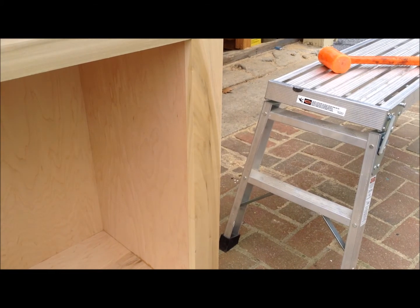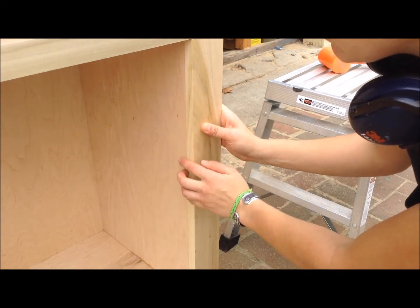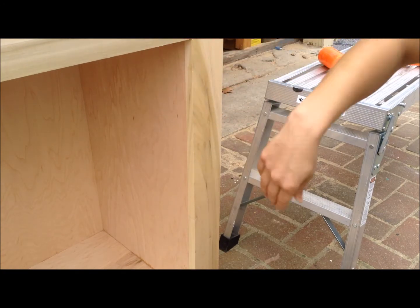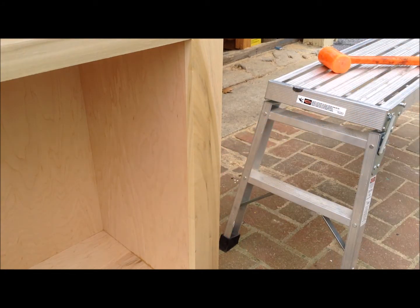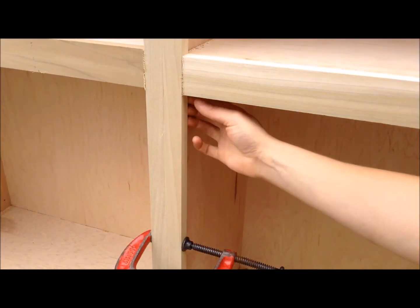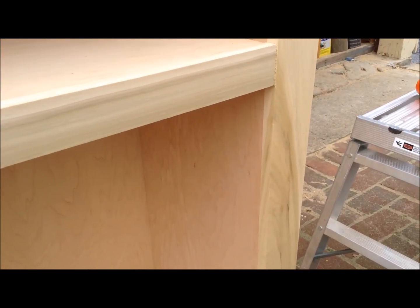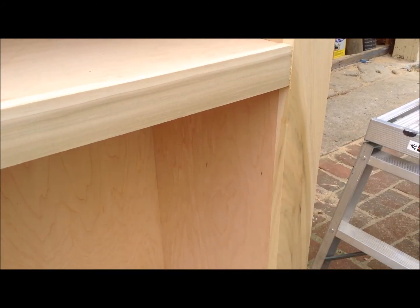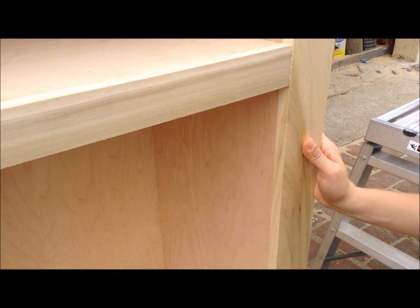So as I'm putting all this together, I was thinking about making the cabinet doors, and I noticed that I'm cutting all the grooves in the back of these flush, which works out for the shelves, but on the two sides, unlike the middle where you'll have a lip to attach your hinge, on the side there is no lip, and they make hinges for frameless cabinets for inset doors, because these doors are going to be inset doors.